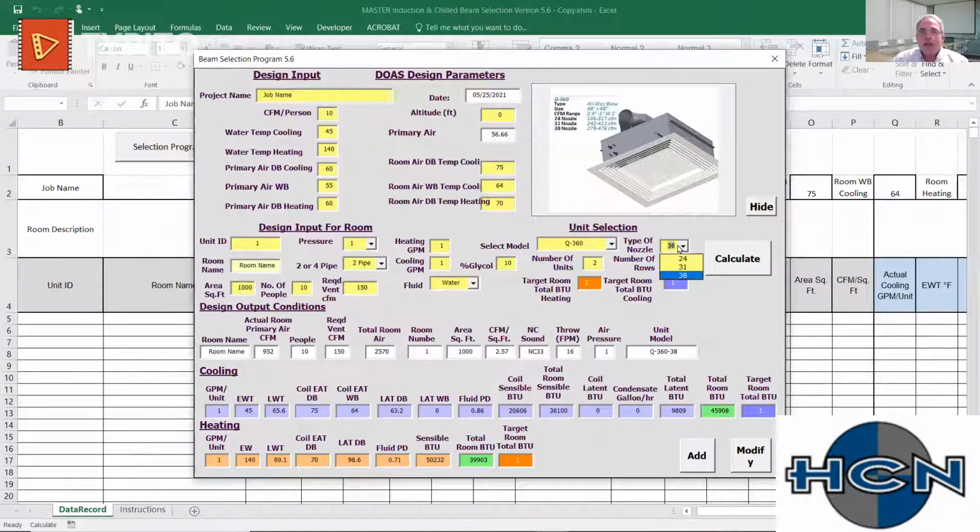So to save a little time, I know we're going to have to be with about the medium-sized nozzle at, say, 0.4 if we're going to hit about, what for a classroom, 450 CFM of outside air. Now, I'm putting that there just as a reference, so I know what I have to hit right here.